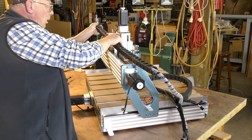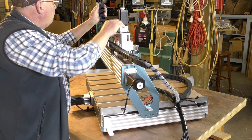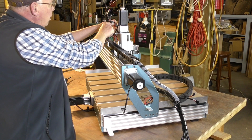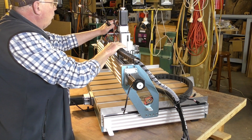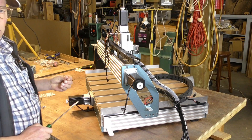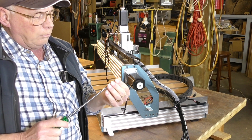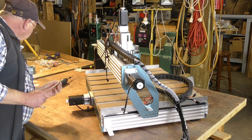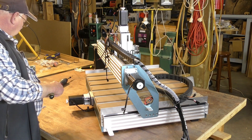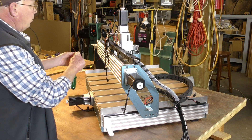My suggestion would be to start with the top of the gantry, the X-axis. Just lay it flat and hook it in on its rest here and lie it over like so. I'm going to connect the top up here first, and for that you use these four millimeter screws — the little tiny ones, four millimeter by six millimeter long. These are countersunk head screws.